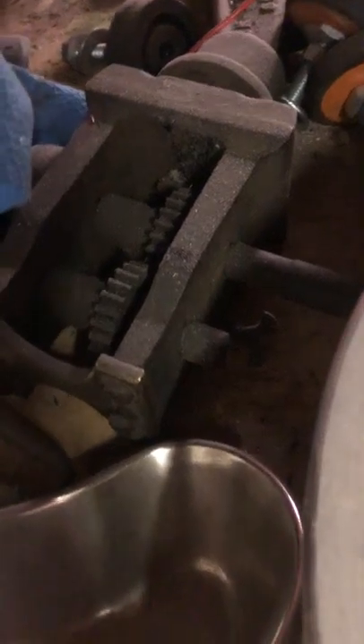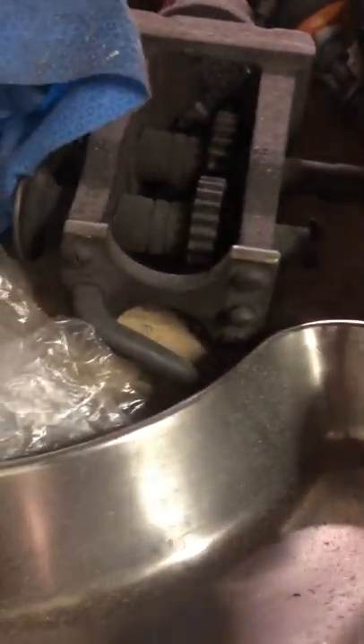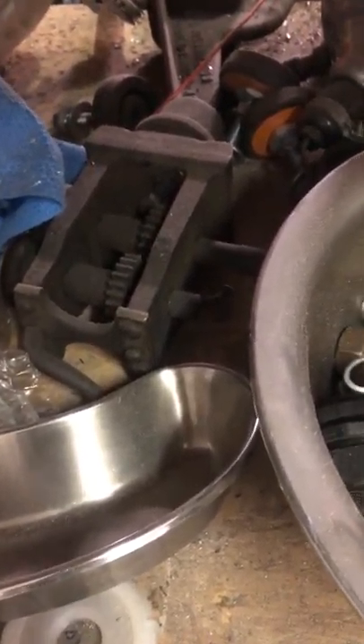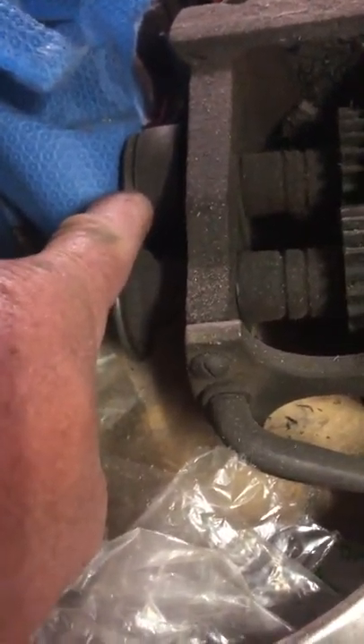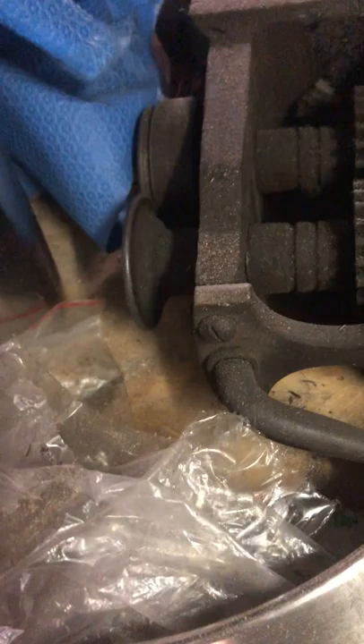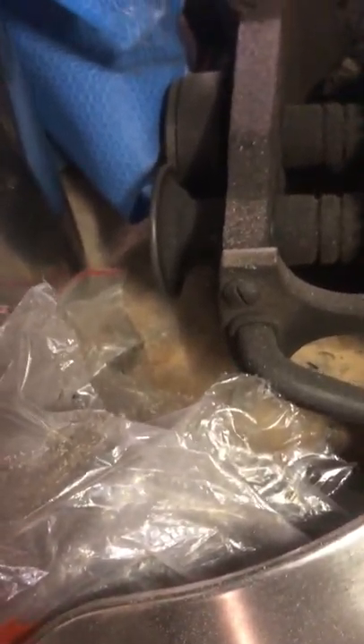And there's this thing down here — it's another metal forming machine that's over 100 years old, and it still works really well. They just used it to make buckets from what I understand. The roll goes into that groove there, turns a groove in the round bucket which they put a wire in, and there's another set of attachments they put in there to grip the wire through the metal bucket.